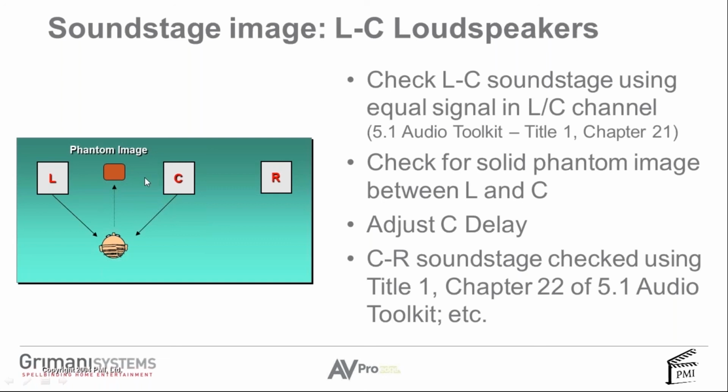Yes. Okay, so that zigzaggy thing is exactly what Samir is asking about, that the phase response isn't quite right. As you roll through the delay, phasing in and out, your perception of where the sound is, rather than linearly travel with the delay, kind of goes zzz, and you have to take the time to go through the whole process to figure out where the right location is. If you do your work correctly early on, checking all the things I talked about, equalizing and making sure that the phase rotation of all of these speakers is right, that will not happen. Instead, you have a really even displacement as you increase the delay.